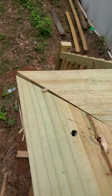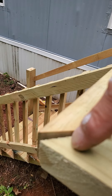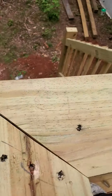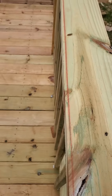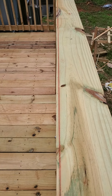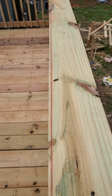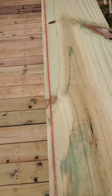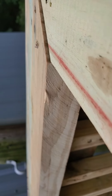Up here on the deck, starting at this corner — they didn't even try to straighten it up. You could probably pull one board up and push the other down and put a fastener there to make it much better, but they didn't bother. Looking down the line, you can see how twisted it is. And there's a red chalk line that will never go away — you can't wash that out. When you pop a straight line on a crooked board and cut it, if you're going to pop a line you should use yellow or blue, not red that's going to be on this deck forever.